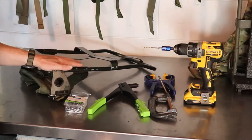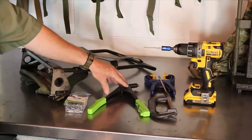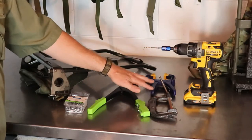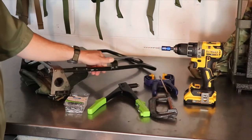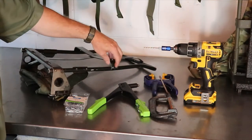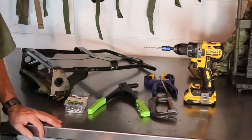Let me go ahead and show you what I'm going to use to make these repairs. The repair items are very, very basic. Of course I need to have my damaged ruck sack frame. I have a rivet gun and some steel rivets — these are 1/4 inch by 1/8 inch. I'm going to need some type of clamp to hold the aluminum stays into position while I do my riveting. I'm also going to need a drill with a 1/8 inch drill bit, which is going to be perfect for drilling out these rivets to break them free. And that is all I'm going to need.